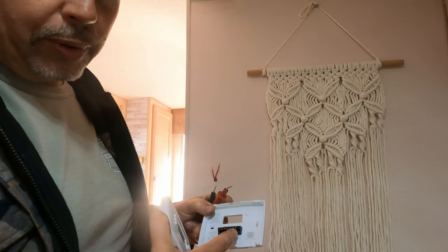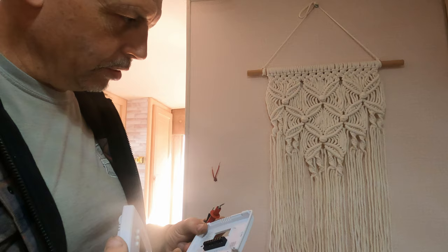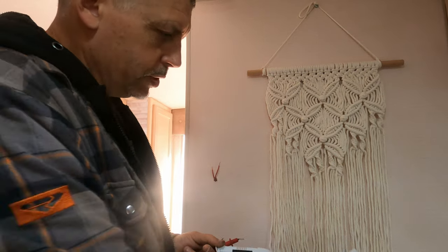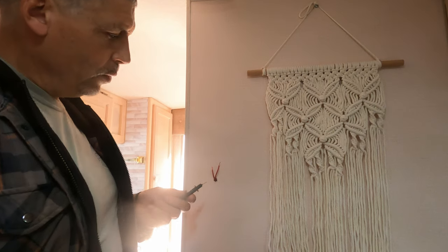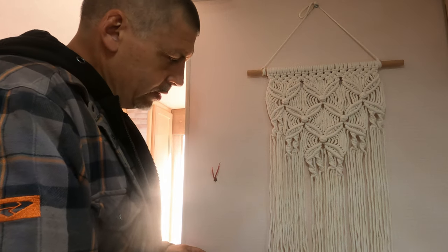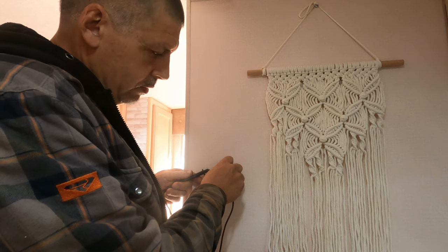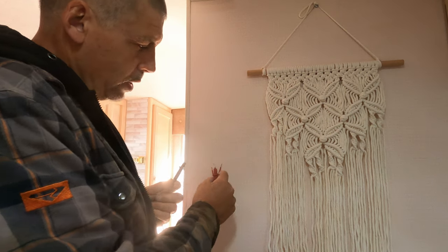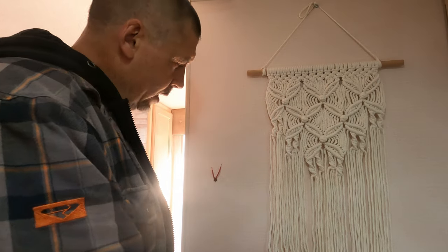R is the 12-volt power and W is the other end of the circuit to turn the furnace on. First thing we need to do is determine which wire is R. We have two red wires, so we really have no way to tell. I just have my voltmeter here — I'll measure between the two and see which one is positive. The one on the right is my R, the 12-volt positive, so we'll hook that one up.